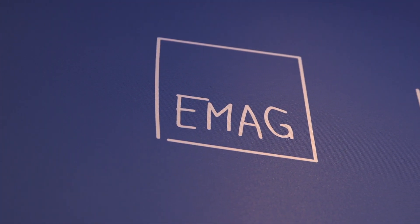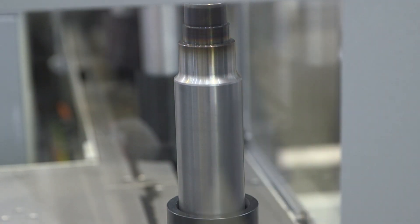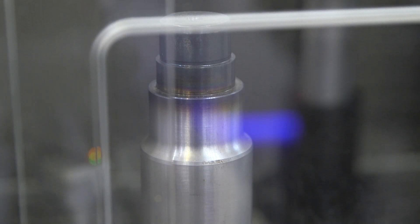We're stood in front of a VLC 100 IH, which is obviously induction hardening. The process shown here is induction hardening technology. For this workpiece — a rotor shaft — we harden the lower and upper end journals of the rotor shaft within this machine. We'll see much more of this rotor shaft in future, as it will be a main part of an electrical engine for e-mobility.